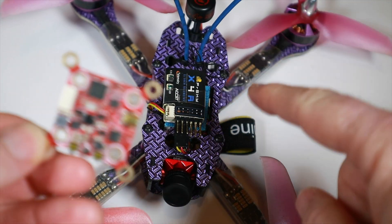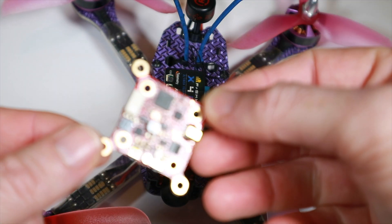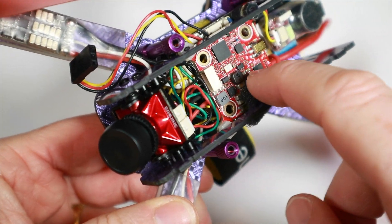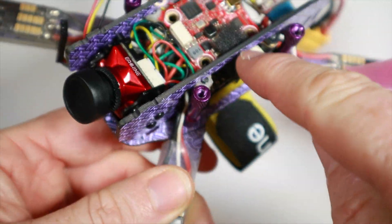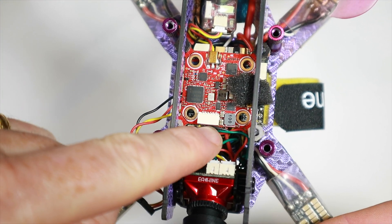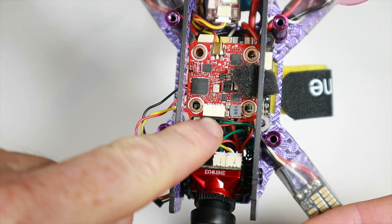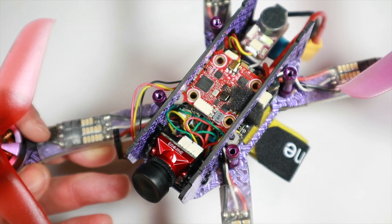We'll be putting this on this quad — it's still got the Forward VTX in there so it should be pretty easy to swap. The new VTX is now installed and I've got a piece of foam with a little slit cut in it placed along there — it's held in loosely. I wouldn't be surprised if that flies off mid-flight but I didn't want to compress it too tight. I had to solder this one in because the old one was soldered in too, which was a little bit tight, but it went in okay.